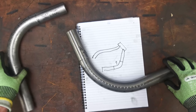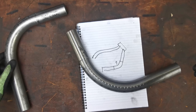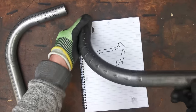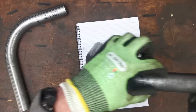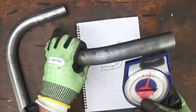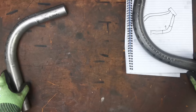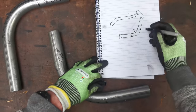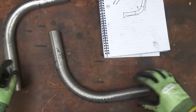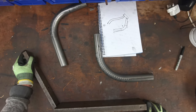So if I wanted a slight bend going up there you can use this as a cheater. It is only rough, it is not exact, but I've found that if you underbend it a little bit and then offer it up you might need to put a little bit more in - just stick it back in and mark up the tube and the follower as to where it all was. Or if you're clocking it, you can stick it in the follower and put a digital protractor on your tube to get it lined up to where it was. Another way is you could clamp something flat there and something flat there and basically make a box. Something like that - that looks about right.